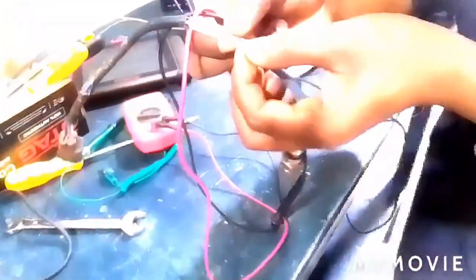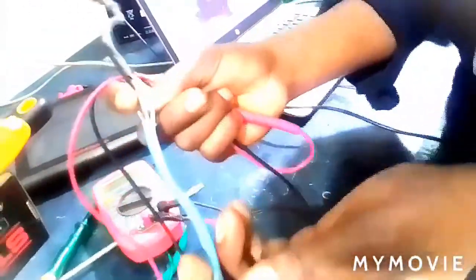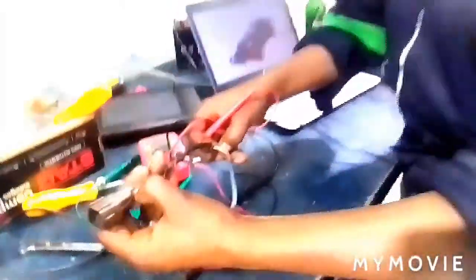Then what you do is check the circuit — the wire which is common, the white wire. These are the ones for the heater circuit. For this oxygen sensor to work, it has to be heated to approximately 600 degrees. So just come and check the two white wires here — they have been merged with the black wires.